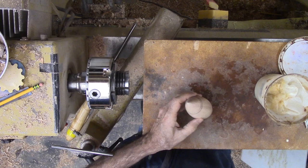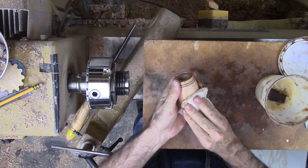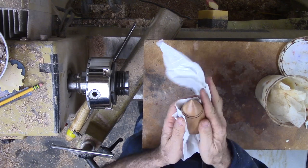For a food-safe finish, I am using a utility mix of beeswax and mineral oil — one pint mineral oil to one pound beeswax. I like my spaceship salt urn. I do not think anyone would, at least at first, recognize it as a salt shaker. It is a simple shape with nothing to advertise and nothing overly ornate, yet still functional as a salt provider.